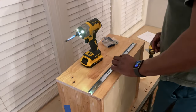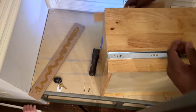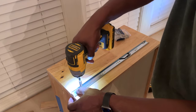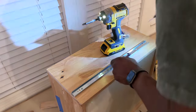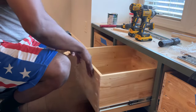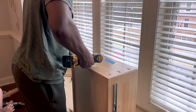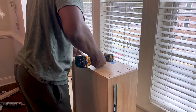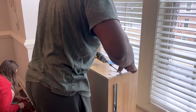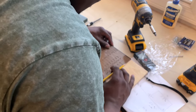I used a flat surface and pressed the front edge of the drawer slide flush with the front of the drawer, then screwed everything in place. Testing things out, I ran into another problem — one box was a little too big. The other drawers slid fine but that one gave me issues, so I took the front face and back face off and cut them down a sixteenth of an inch and it worked out perfectly.